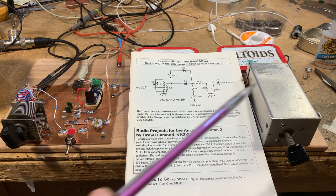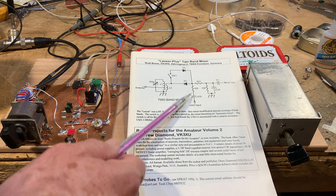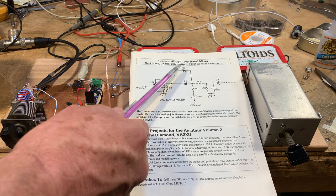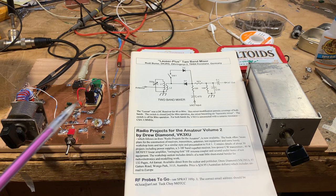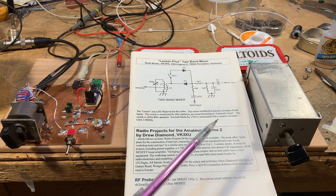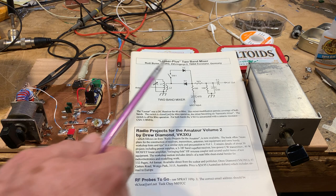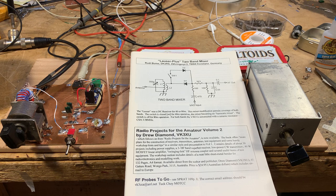It hits these two coils. Here's the heart of the magic: the VFO is running at about 3.5 to 3.6 megahertz, but I'm receiving 40 meters at about 7 to 7.125 megahertz. What's happening is the VFO signal turns on one half of the cycle — it turns this diode on — and on the other half of the cycle, at the peak, it turns this diode on. So in effect the signal is being sampled twice each LO cycle, and that allows you to tune a 40-meter signal with a VFO running at half the frequency. This is one of the beauties of the whole thing.